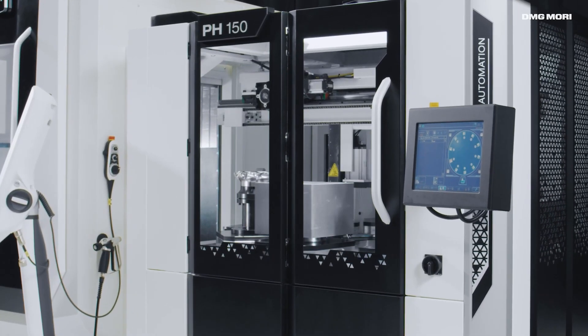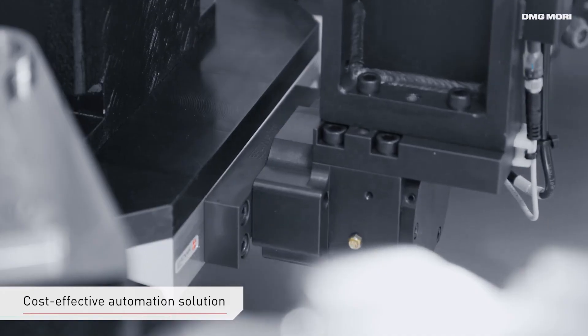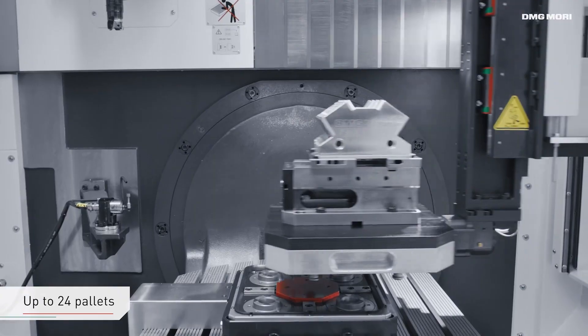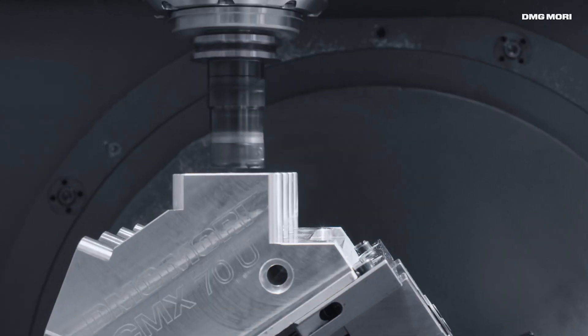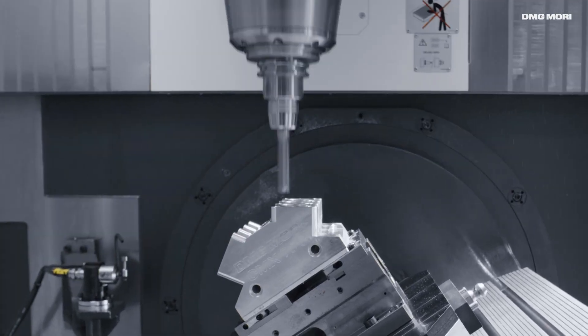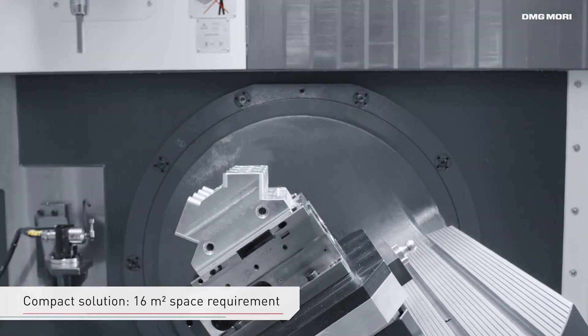Can you automate them? Of course — as you can see from this machine behind us, the shutter on the right-hand side allows you to add automation. We've got standard products in our own portfolio made by DMG Mori — we've got a PH system which is very popular, and we've also got our Robo2Go for milling, so there are lots of possibilities for automation with this machine.